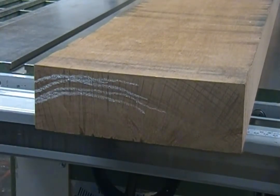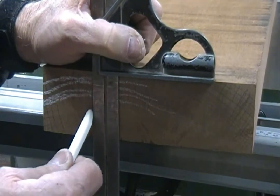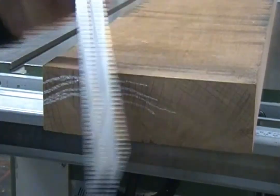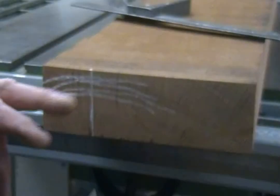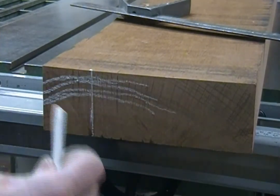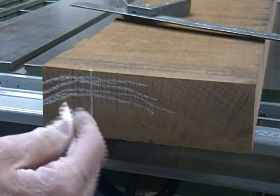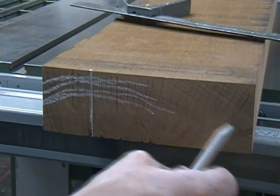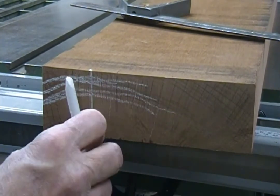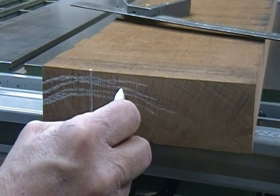When you get over to about here, you're square to those rings. You've got that line right there which is square to these rings — this is your quarter sawn wood. If this is the face of your board, right where you make this cut, now your face of the board is here rather than on top — now this is a quarter sawn piece of wood. Because this is coming out on a radius, as you progress and continue to cut straight, you're no longer cutting quarter sawn.